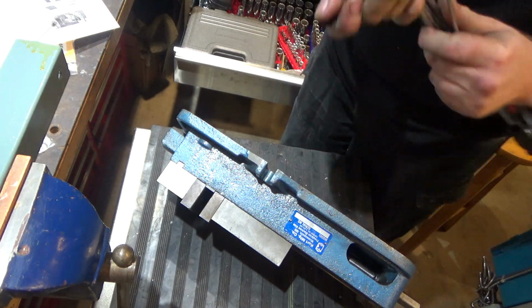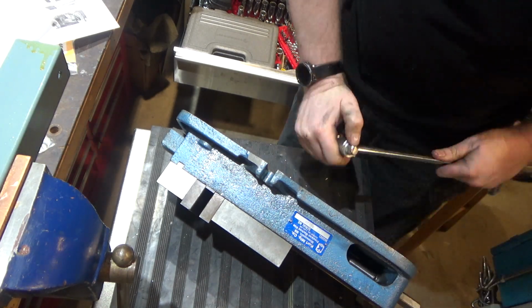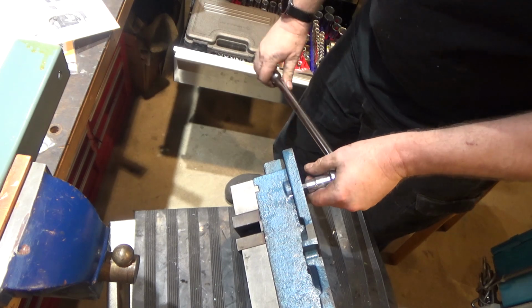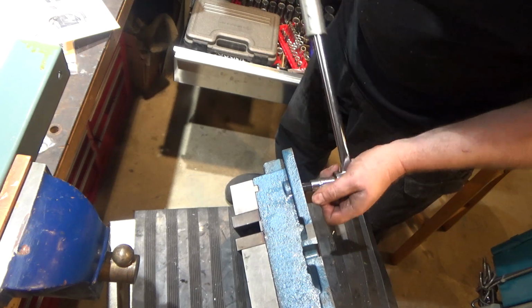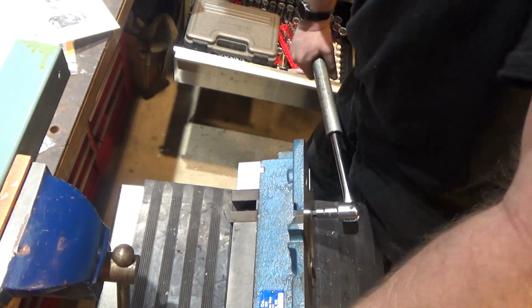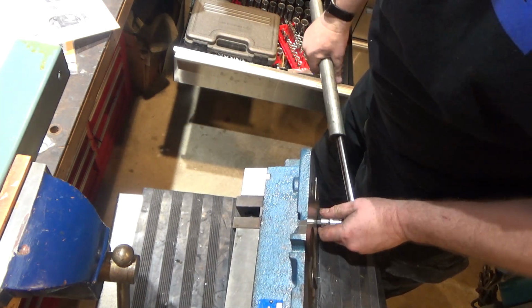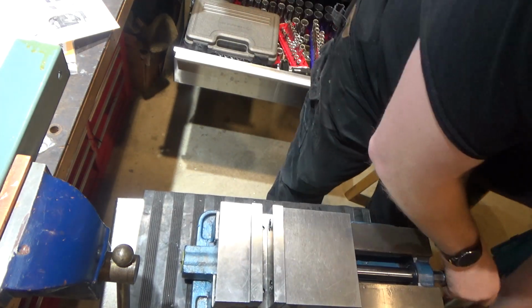150 foot-pounds. Which is going to be very challenging. This was the problem getting it off. I think ultimately you need an air wrench that's heavier duty than the one I had, but okay. I did add some molybdenum disulfide grease to the threads of these, so hopefully next time I will actually be able to get them undone. That was doable.